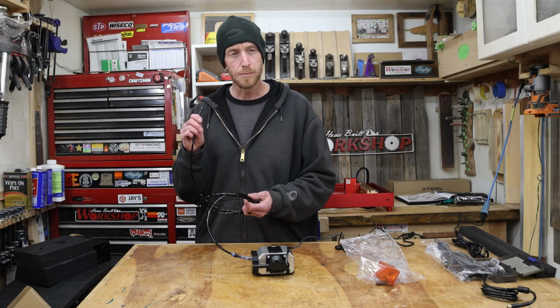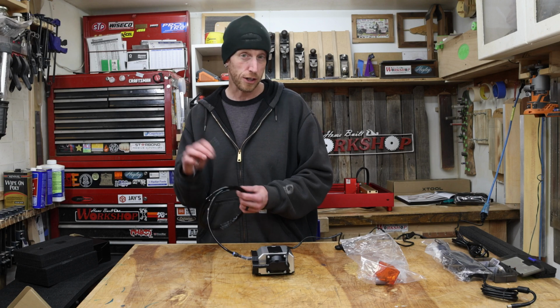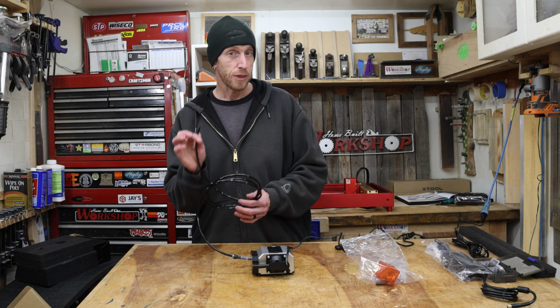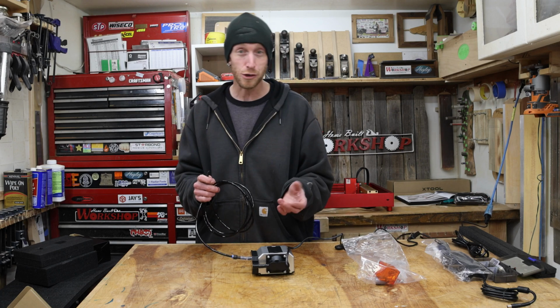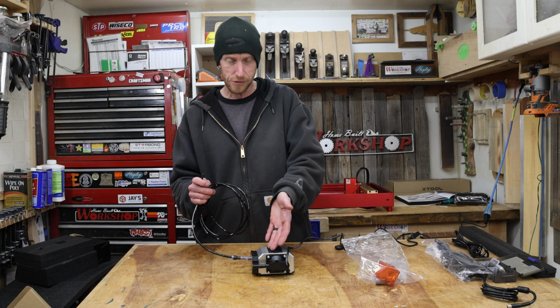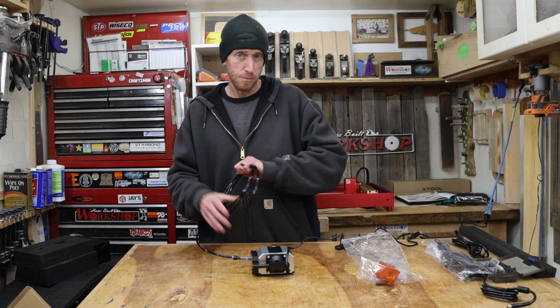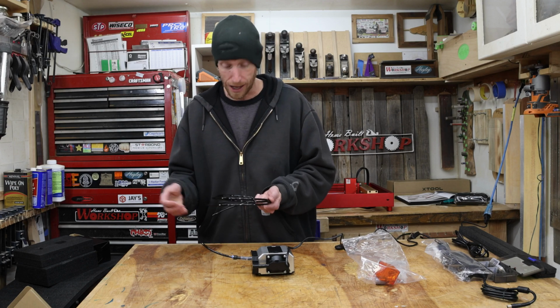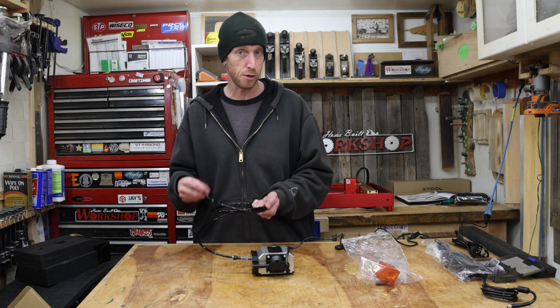This little air pump, it moves a fair bit of air. It's going to be plenty of air to clear away smoke and things. The advantage, let me shut this off. The advantage of using an air assist, whether it's this system or maybe you fabricate some sort of a system, or maybe you have a different machine and it has its own air assist, is that the air assist helps blow the smoke and fumes away from your material.